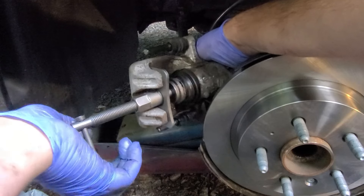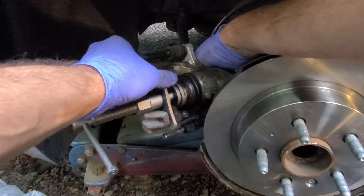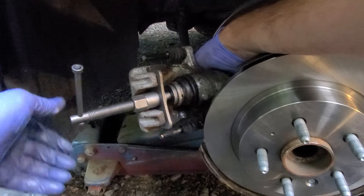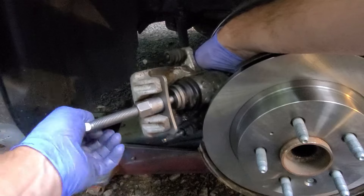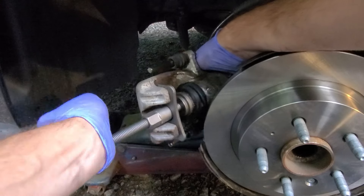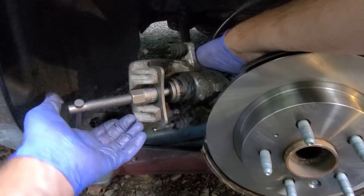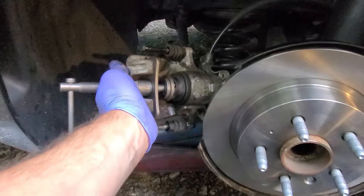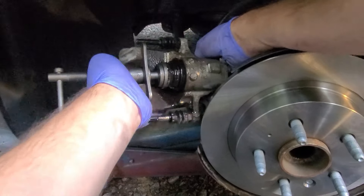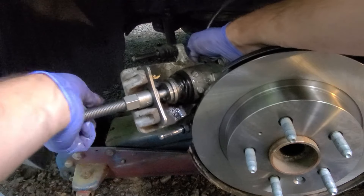We're going to rotate it clockwise. You can see it's going down in there — that boot is not spinning. Every now and then, tighten that up a little bit. If that boot starts moving, spray a little more penetrating oil on it. If it starts to spin a little bit, back it off just a hair and spray a little bit more oil on it. Now you can keep going. If it does bind up, just back it off just a hair until it straightens out, and then you can start moving again.